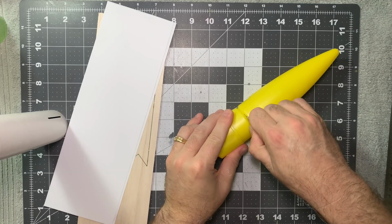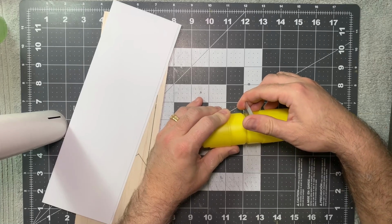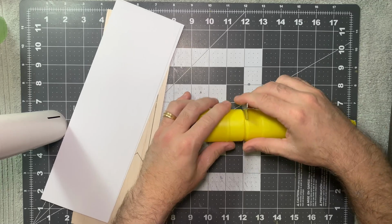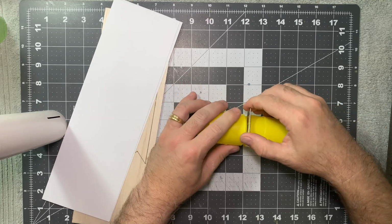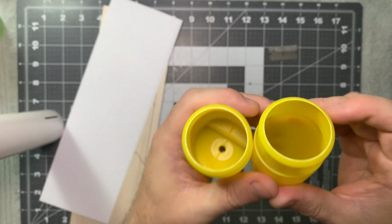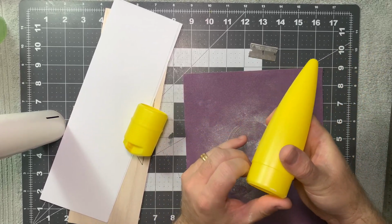So now we just continue to press in, and roll, and continue just pressing into that groove. Lift it out a little bit. Roll and cut, and it will just naturally follow that seam line at the joint. We're almost through. There we go. Perfectly cut, perfectly straight. Now, if you do wish to smooth things up a little bit, because that does leave a little bit of a burr, this is 320, and just smooth that burr off a little bit.